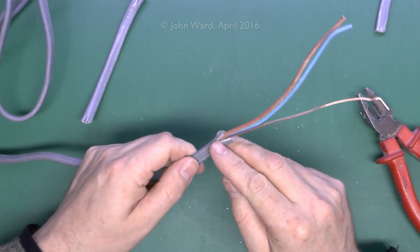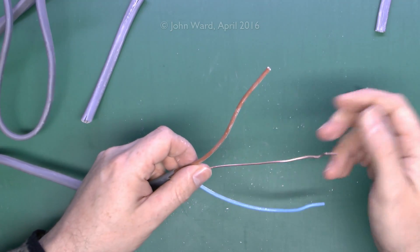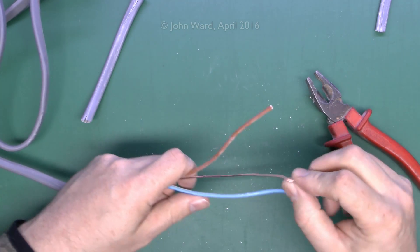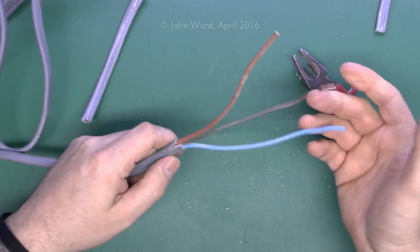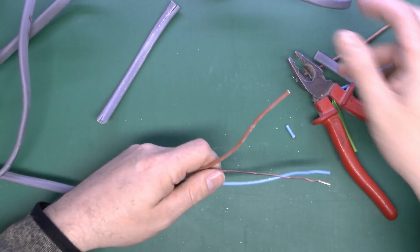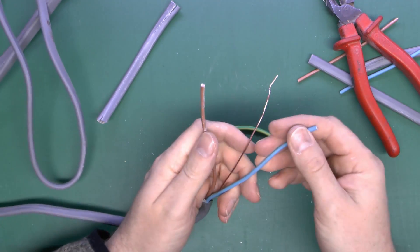This method may leave a rather ragged end. There's also a complete myth that pulling on this wire will somehow stretch it. That's clearly impossible — to actually stretch copper of this dimension you'd need to apply a force of hundreds of kilograms at the very least, possibly thousands. Far more than you can do with your hands. Any stretching is fractions of a millimetre and won't make the slightest difference. What may happen if you pull too hard on a short cable length is that you pull it along the cable, so it ends up short at the other end — but the myth about stretching is just that, a myth.